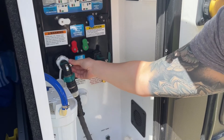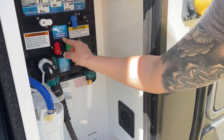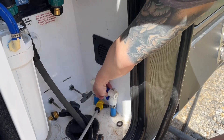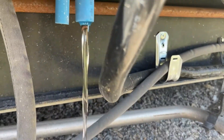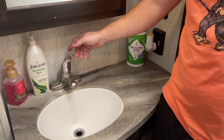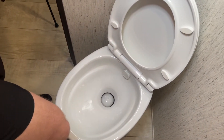The first thing we have to do is cut our water off — we're going to cut that off there. And there is the low point. Ignore all the sand — this was from Joshua Tree. We're going to flip this out and drain all that extra water so we can remove the toilet without any leaks. One of the things you always check for is to make sure it's drained. We're going to lift up the faucet — nothing's coming out. Come over to the toilet — nothing's coming out. And we're ready to get started.